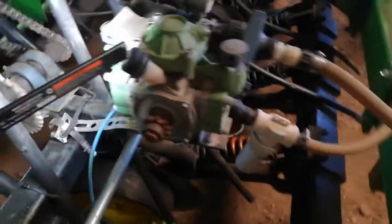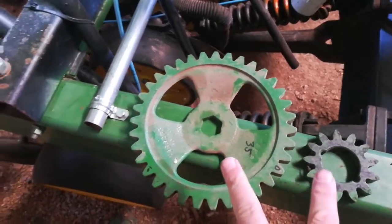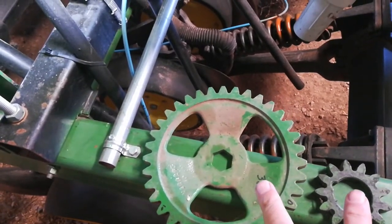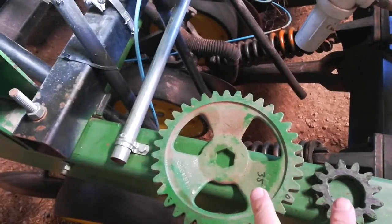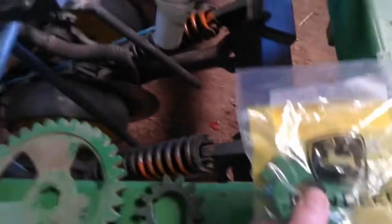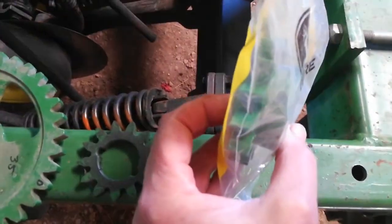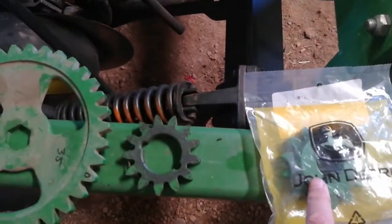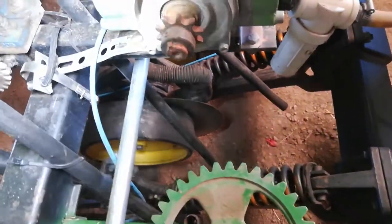What Deere does is sell a half-speed gear kit which consists of two gears. Crucially for my purposes the part number changes by serial number. I bought this set and one of the two gears is fine for my serial number, but apparently I needed this other gear — three hundred dollars — which you can see has a hole where a roll pin goes through, where it slips on the shaft. This gear replaces that spur gear.